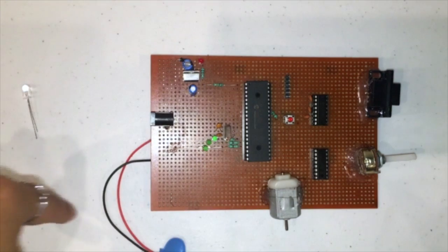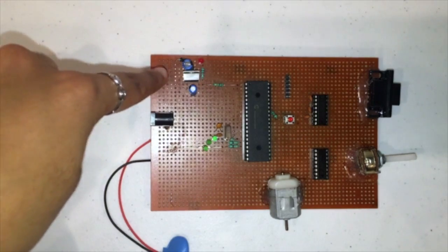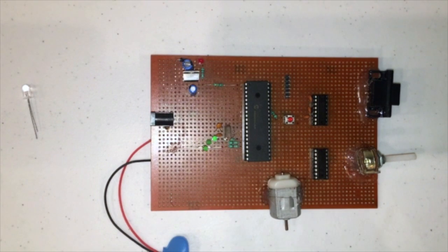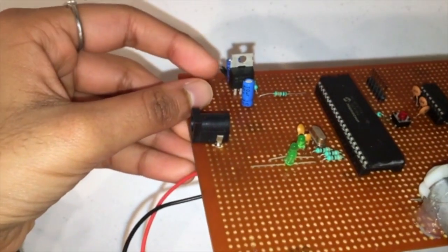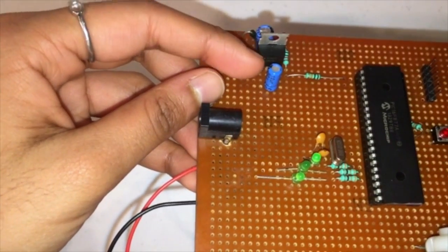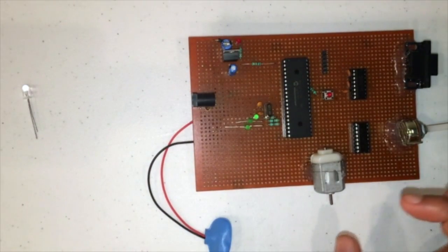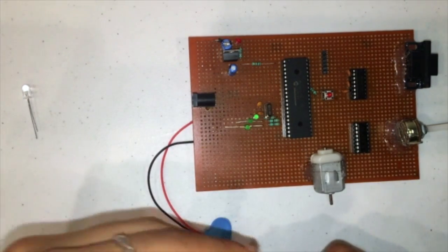The voltage regulator is directly connected to your battery, and it has 3 pins: in, ground, and out. This is the 7805 voltage regulator, and to identify which pin is which, you're going to want to hold the regulator up like this and make sure that the writing is from left to right. So in order from left to right, you have in, ground, and out.